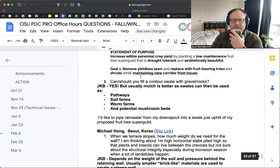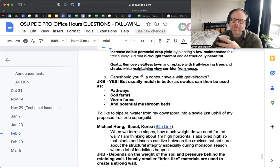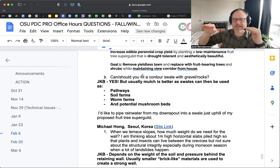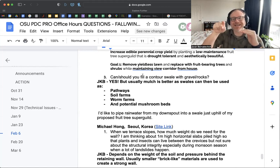On small scale sites, we'll create swale trails — swales or just a level ditch — and in it we put wood chips. The way we usually do this is mound it up high in the center because over time it'll decompose and generally you walk on the center, so it's important to keep the center high or else it'll become an indentation. If you take a downspout and use what we call big O piping in Canada — black corrugated plastic, three and six inches, can be perforated — take that downspout and put it in the center of the swale trail in the mulch. That water comes into the swale trail, seeps into the ground, and continues along.